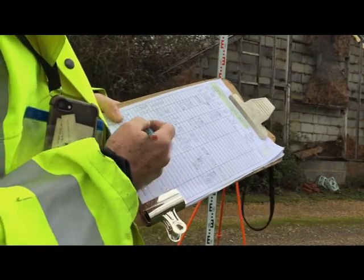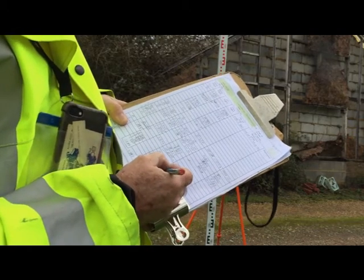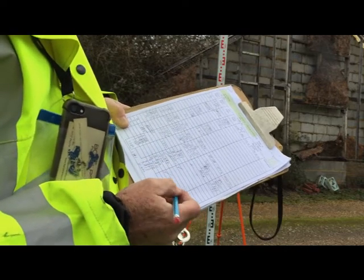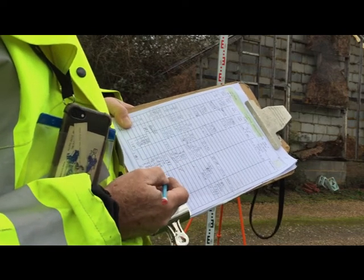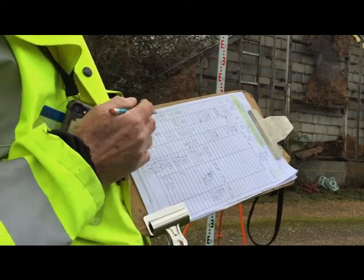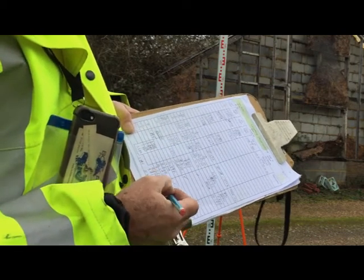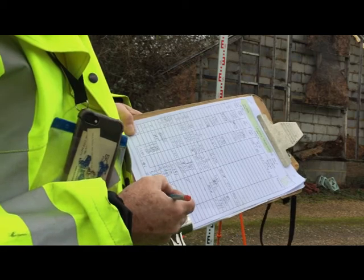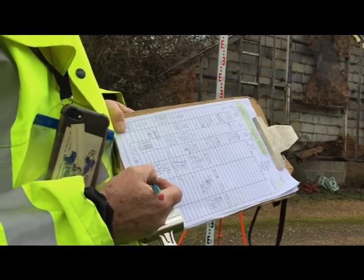So we got station C at 9942 conventional leveling and 9944, so 2 millimeters, which is pretty good. Station D, I had 10.192, and D on this is 194, so again 2 millimeters. Very good. Pole number 1 was 9805, got 9806, 1 millimeter. Pole 2, 805, 805 exact. Pole 3 next to the trampoline, 915, 915 exact.